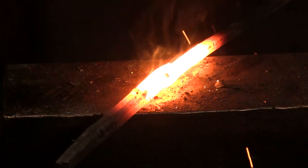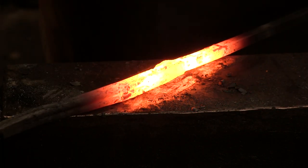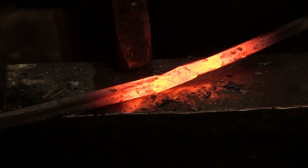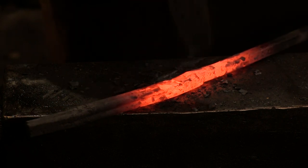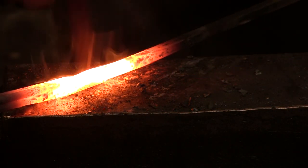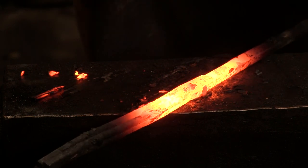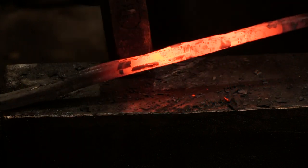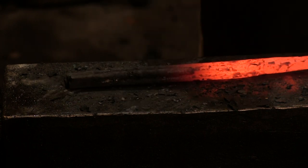We've got a good heat — tappy tap tap. Make sure and go for the lips first. I didn't get a good fusion right there on that one, so I'll come back, reflux it, take one more heat, seal that up, and then bring everything down to a taper. Got everything straightened up — it looks like we've got a good situation, everything is nicely fused in, and now we can get into making our hook. Not too shabby if I do say so myself.